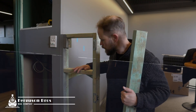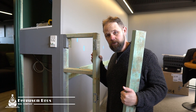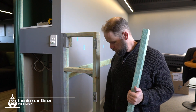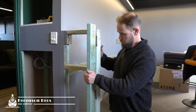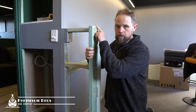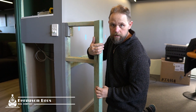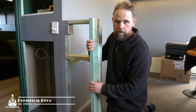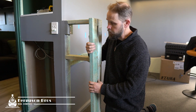I've added a little bit of extra structure in here just to get this vertical post nice and straight. Next thing to do is put the hinges in. We're going to put this first part of the gate against the hinges, flush for the top, with it about 5mm off the ground so when it hinges there's a little bit of clearance. We'll basically build the gate in situ so it's nice and plumb and exactly the same shape as the surrounding frame.